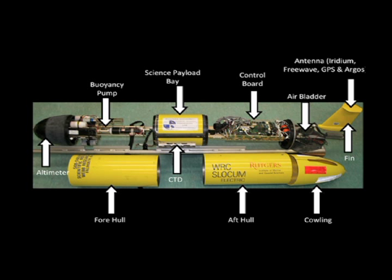The buoyancy pump is a piston motor that'll push back or pull forward, which allows that water to enter the system or exit, allowing the glider to dive or climb. Next we have our science payload, or the science bay. This is a really neat tool that the Slocum Gliders have, because that science bay can be outfitted with various sensors, so you could essentially take one glider into the field with you but have multiple payloads so that you can change your science objectives and sampling game plan on the fly.